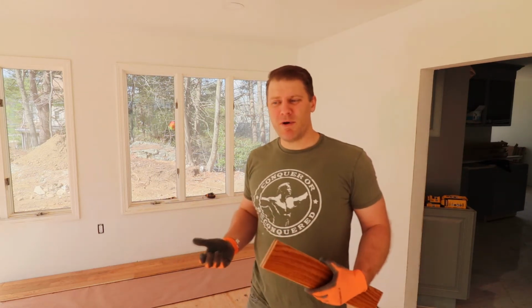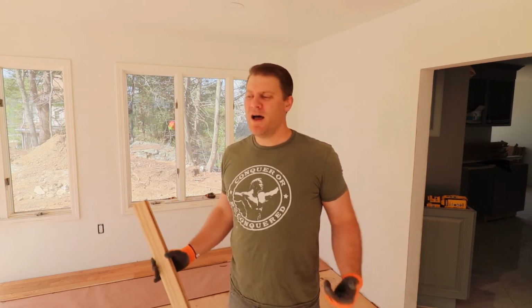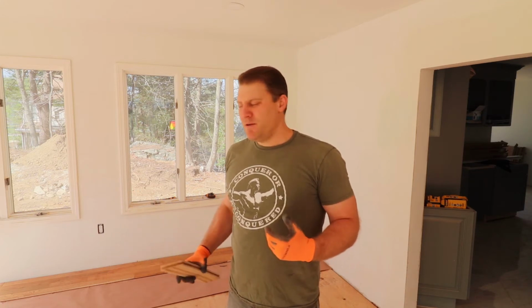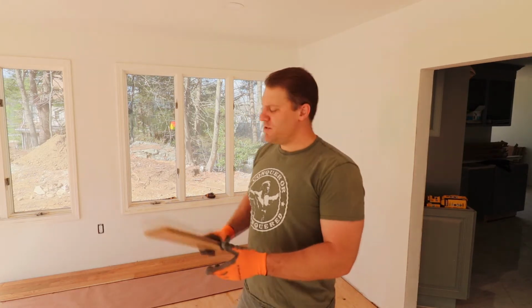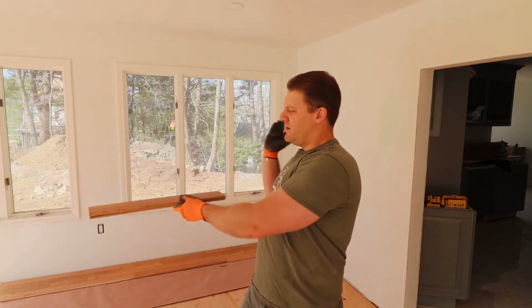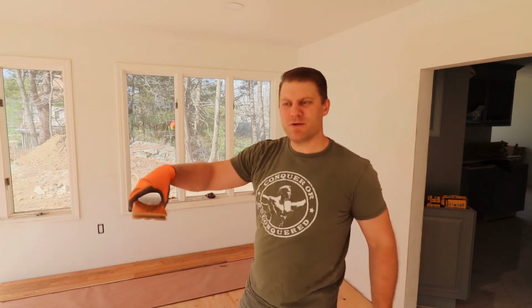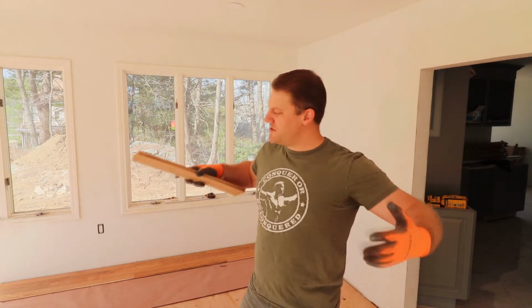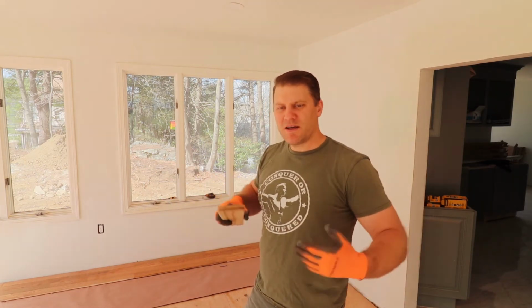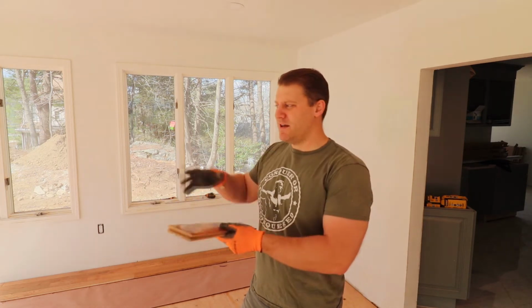So I want to make this really good and a nice appeal. When people walk in, they go, wow, this is unique. The whole house is craftsman style. I'm not going to cheap out on the design or be lazy with the design on where you walk into the house. So the 2x2 design is essentially going to be 2 rows of flooring running on each side, then run 2 rows across. Another 2 rows coming down, 2 rows. What happens is you have this really interlocking pattern. I guess you could call it stair stepping, but it's really not because you have 2 rows locking everything in.